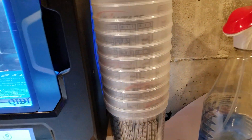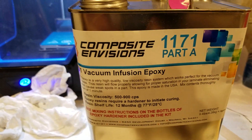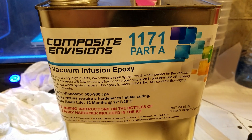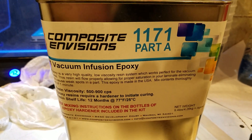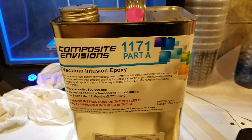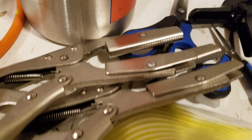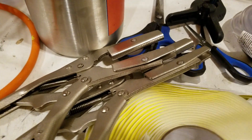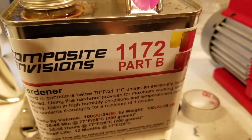Then you need some cups — I like the paint cups for mixing the epoxy resin. Here's the epoxy resin I use; this is great stuff, I've used gallons and gallons of it with very good results. Make sure you use epoxy — I've tried using polyester resins and they just aren't strong enough for doing these panels; they actually will peel away from the 3D printed part. You'll also need some hose clamps, which cut the hose off and stop the flow of either vacuum or epoxy resin. And then you'll need a hardener — you get the 1171 and the 1172, these are really good epoxy resins.